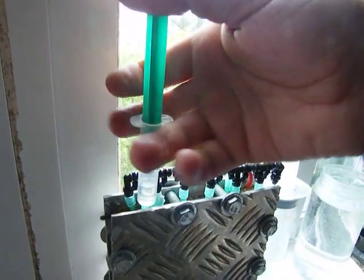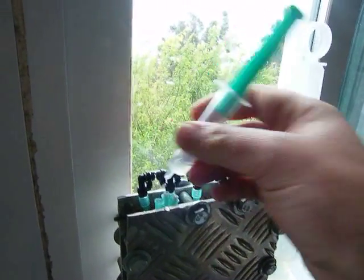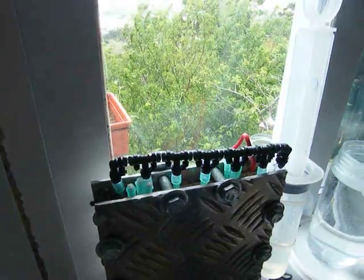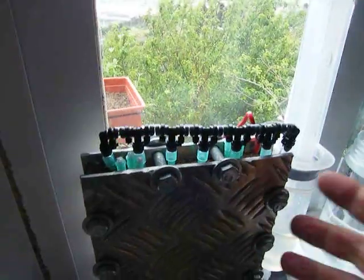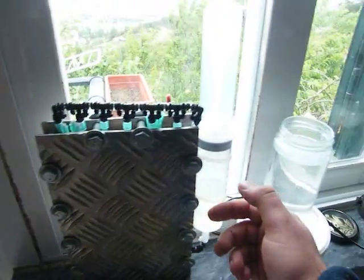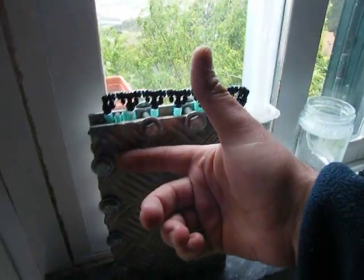The only thing you have to do next is cover this up, because you really don't want electrolyte hanging around in your home, and take it off. After that, just put the cap back on. You do it for each and every one — there's six, so it's not really that difficult. Also, if you want to remove all the water — for example, to change the concentration of the electrolyte — you take the caps off, take the water from the reservoir, and press air into it with the cell turned upside down, so all the water comes out from these holes.